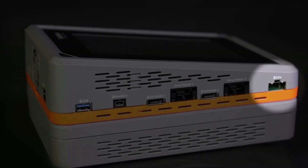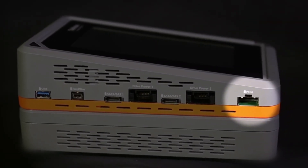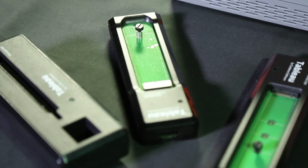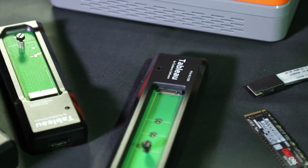The TX1's PCIe write-blocked port is used to image various types and form factors of SSDs. There's also a PCIe adapter used to image IDE drives. PCIe-based storage technology is an area of ongoing change. Expect additional TX1 adapters as new types of PCIe storage come to market.